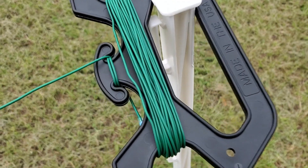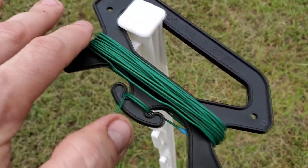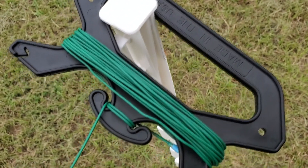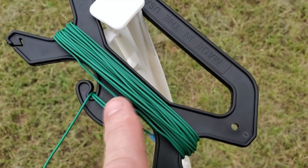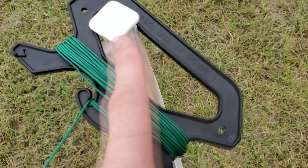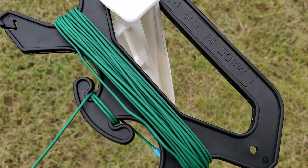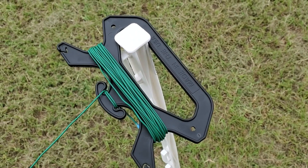So what we discovered out here when tuning this thing with the analyzer: you make your wraps — micro wraps — on the center section. We're on 20 meters right now and we got it down to 1.13 SWR. That's pretty fantastic. So when tuning with your analyzer, remember to do micro-tunings using this little section of the wire wrap — you can really fine-tune this thing right down to where you want it. At 1.13 I think we're good — I'm not going to push my luck trying to get any lower. That's your first pro tip.